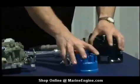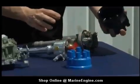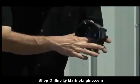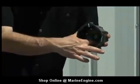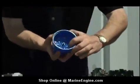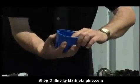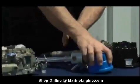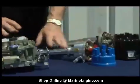The caps on the distributors are also different. On an automobile application, the caps generally use aluminum terminals, which are highly corrosive in the marine environment. The caps on a marine application are brass, which are very good conductors of electricity and also stand up well to the harsh environment. This has been a quick rundown, but it's just the tip of the iceberg on what makes marine parts different from their automobile counterparts.